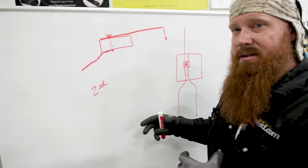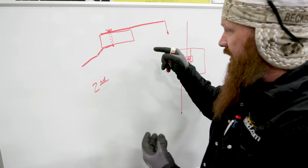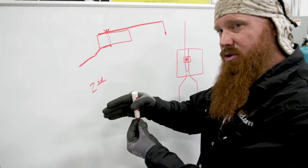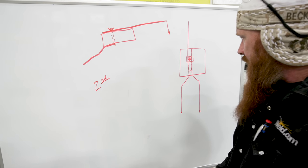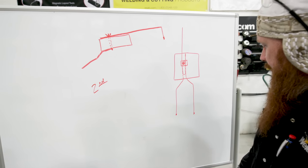If you're working on something that's next to bearings, you can run that electrical current through the part so it doesn't have to travel through a bearing — it'll keep your bearings from arcing out. So let's go ahead and get to it. We're going to start off by cutting and bending some pencil rod.